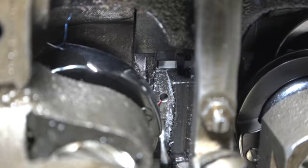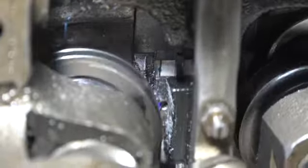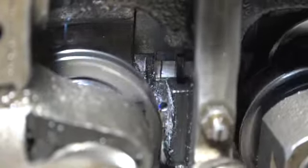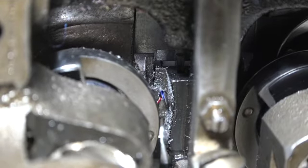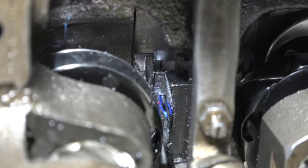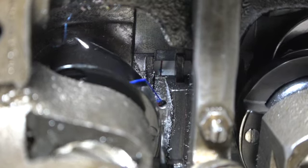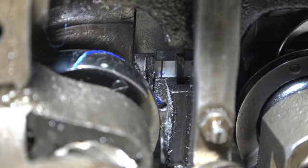There you go. Because in real life, it's going this fast, and I'm just doing this by hand. Can you imagine this being done by the machine? This is what I mean about the quality. It's very important that the feed dogs, all of that, need to be machined, not just cast with rough metal and simply drilled with a drill bit and called good. You have to dress up those holes.